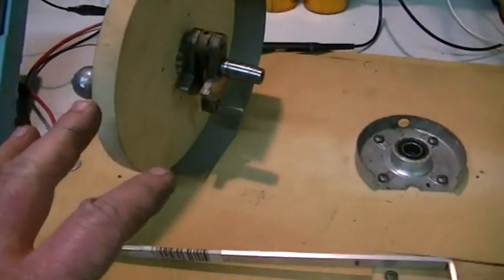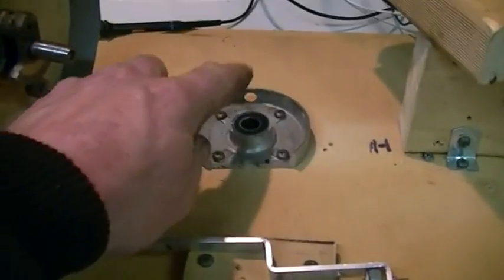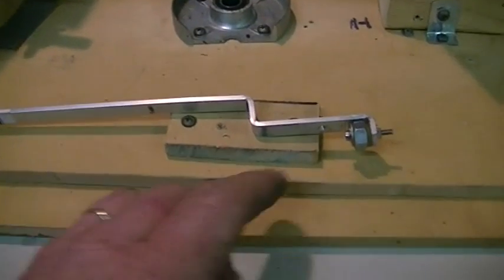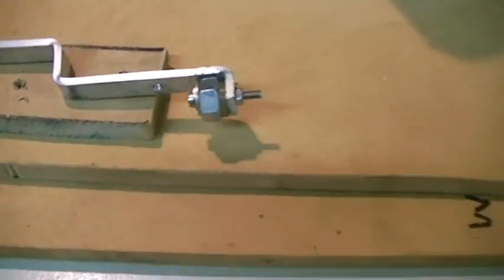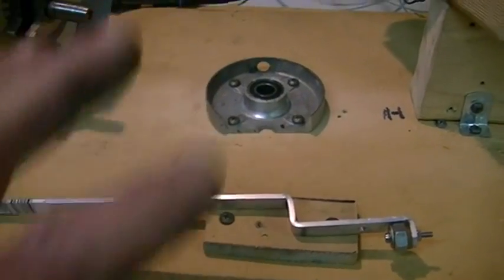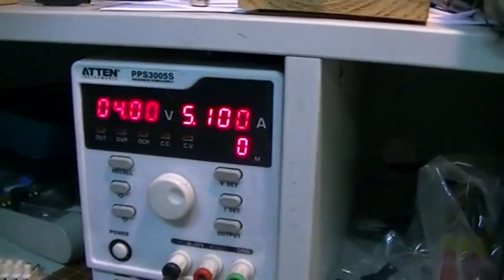Okay, as you can see, we've got all new bearings in there. The other ones were a little bit loose and notchy. These are a little tighter but I'm not going to worry about that because they will be the same throughout the test. I've bolted a nut on here with a couple of washers, which is the same weight as the magnet, to keep everything even. We're going to give this a run-up without the magnets installed and see how much current we're drawing at the four volts we'll be running at.